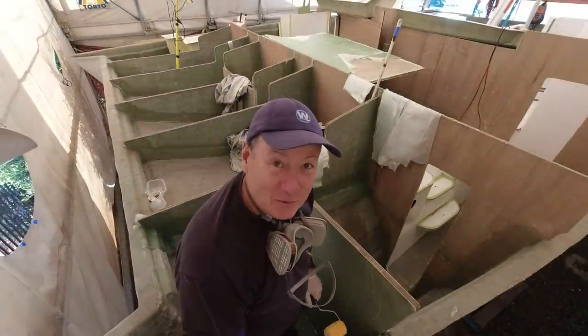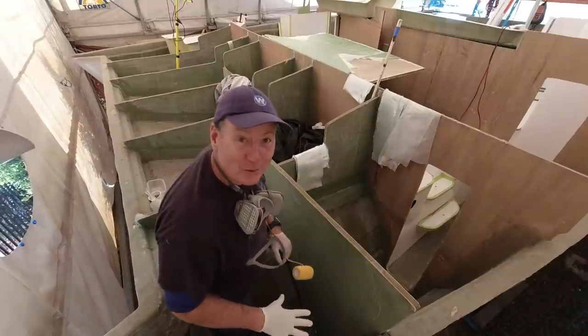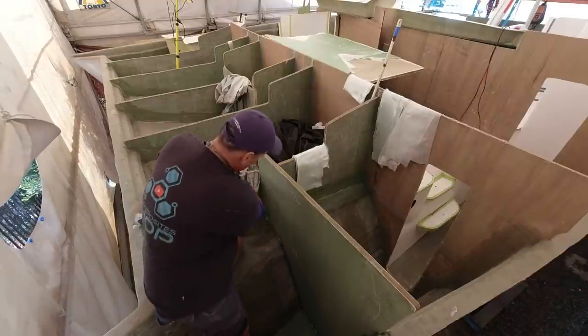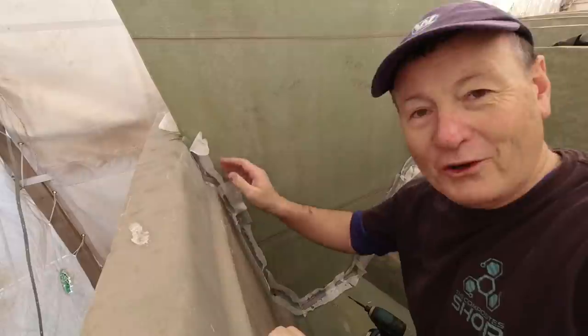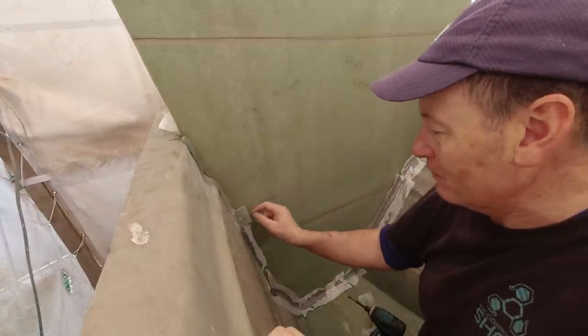You want the cloth — the 600 double bias — to impregnate into that fillet. That gives you the bonding strength. Very important that it's tacky, even wet if possible, when you're doing your tabbing, so you're not ending up with a secondary mechanical bond. Now I've been dreading doing this part because I'm jammed in this little hole for a few hours tabbing in this bulkhead, but it's made a lot easier by having this crash bulkhead underneath me secured. This bulkhead does actually need to be cut to the shape of the boat but I'm not going to do that until I get the deck in here.